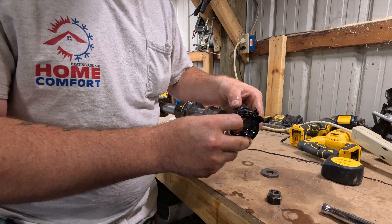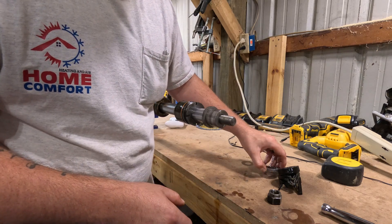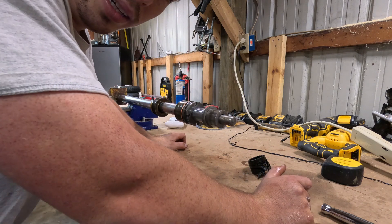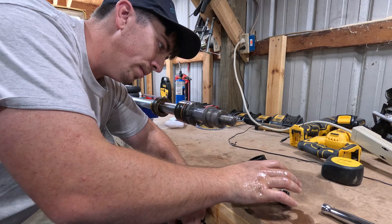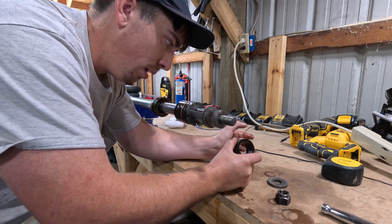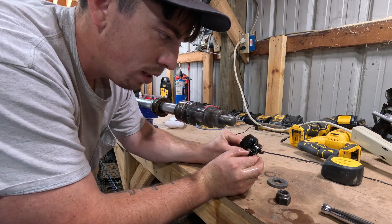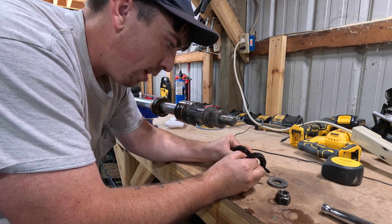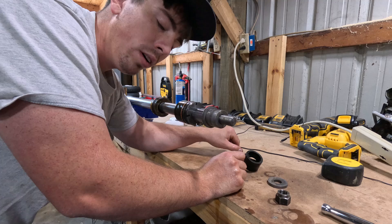This is the main one that is torn up — the most important one. I don't know if they're going to have anything like this in stock today. I'm just going to go to a hydraulic place that I used to work at and get the seals, because I don't have calipers right now to take measurements and search through to find this seal. I know they have catalogs, maybe I'll be able to find it. When I first pulled this out it looked more like a wide wear band with a seal in the middle, but it's not — it's a kit with many layers. So we're going to grab the other one, tear it apart, take a look at it, and then hit the road.